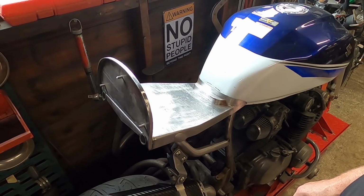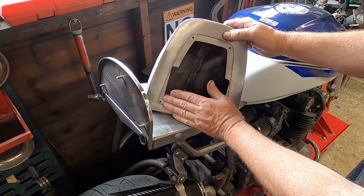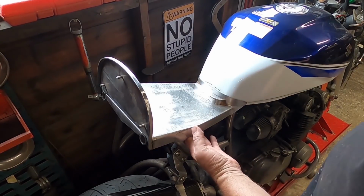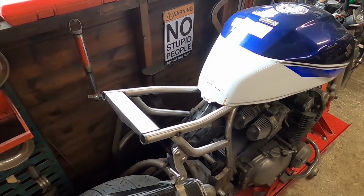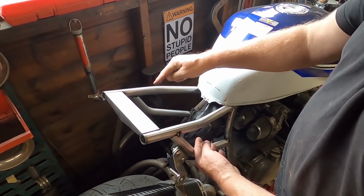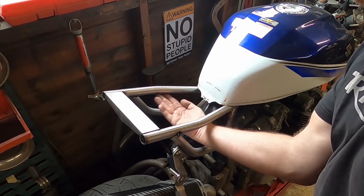So, hiding the wires. I think as we're going to have a nice flush base on this, obviously you're seeing we've got the number plate bracket that comes off there and that, so this will be nice and flush. I think if I make another pan under this seat, let's take that back off. Yeah, if I make another plate under there, the same size as the seat pan, and we get some little tabs where it can bolt up from underneath, maybe just 4 little dome heads from underneath, so the bottom is completely flush.